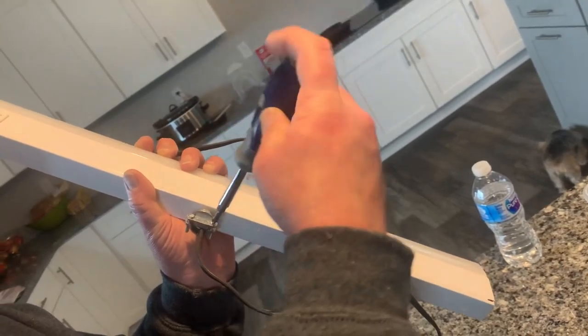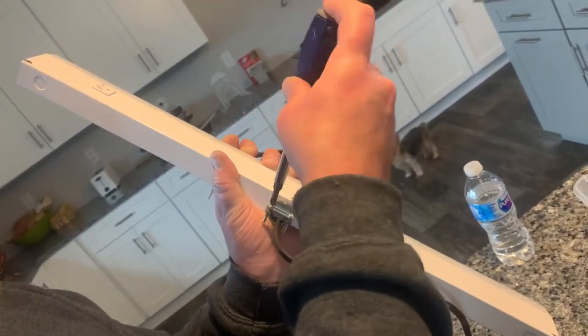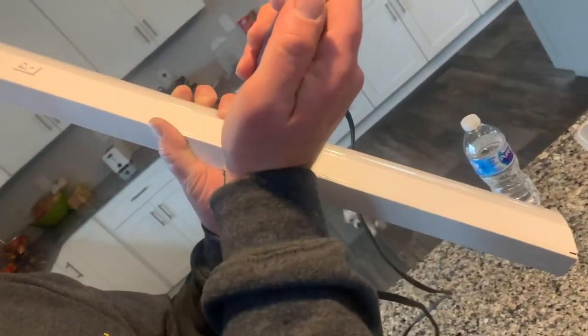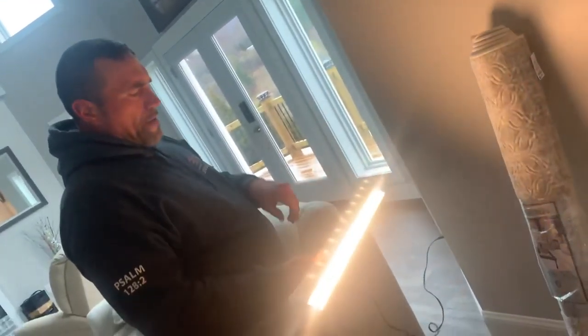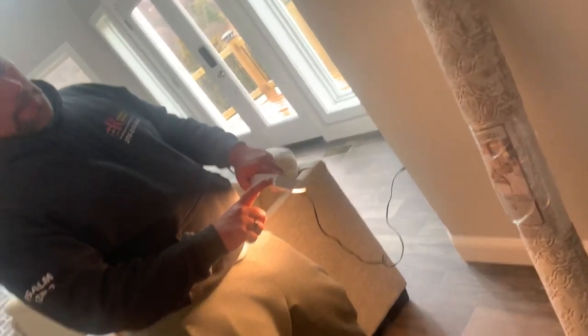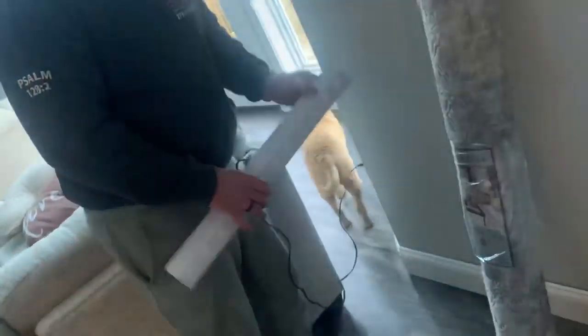That looks NEC compliant, everybody. Now try it out — look at that, how fast! Now, if you've got two or multiple ones under the cabinet you're going to attach, all you need to do is knock out another punch out here and connect another wire to the same black, white, and ground. You jump it over to your next light, go into that light, and hook up the black, the white, the ground. Now you have two of them working in series. And that's all — thank you.